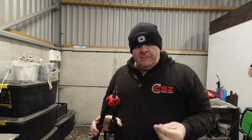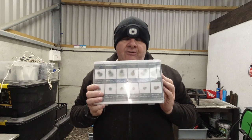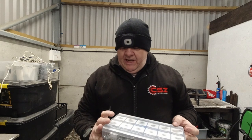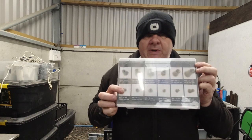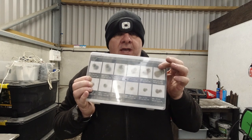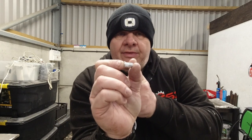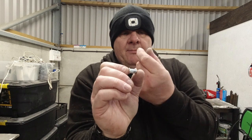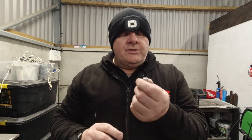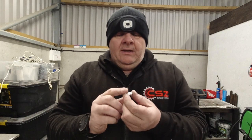I'm going to be using M6 riv nuts, which means that will take an M6 bolt. You can get riv nuts in all sizes — in this box we have right down from M3s, and they go all the way up to M10s. So you have many different sizes. Another thing with these riv nuts is the length of them. If you're going through quite thick metal you can get longer riv nuts so they can clamp onto a thicker bit of metal. The M size is the bolt size and then it will give you a length size — the longer, obviously, the thicker the metal you can put it through.